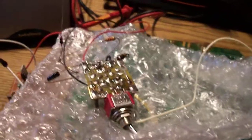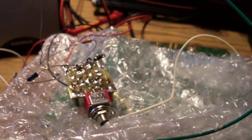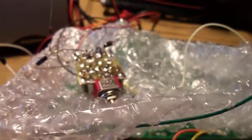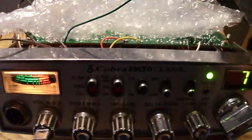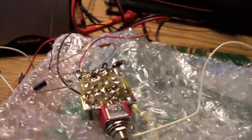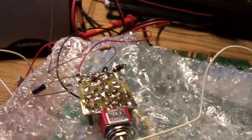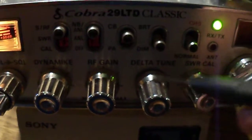First off I'll show you a crystal oscillator I'm using to force signal injection on C87. Those who have ever channeled one of these radios in the past will tell you that the only way you could channel or expand the frequency range is to use a crystal oscillator and connect to capacitor C87. You'll see a varactor diode, a resistor, another diode, and a 10 microhenry choke. That is the tuned single crystal oscillator — using the delta tune as a clarifier.